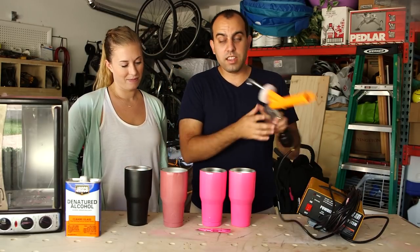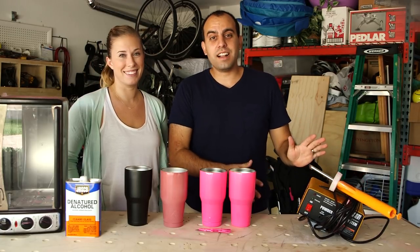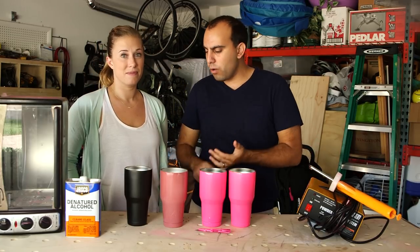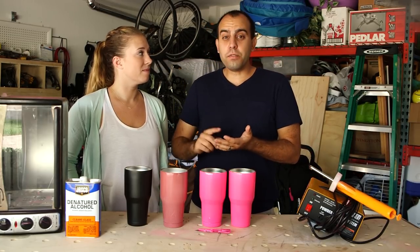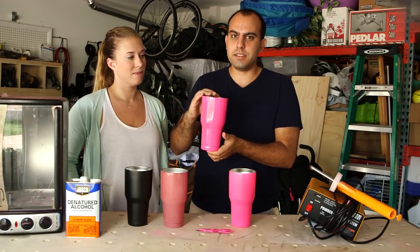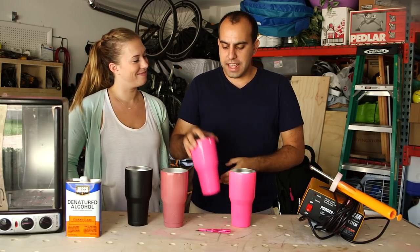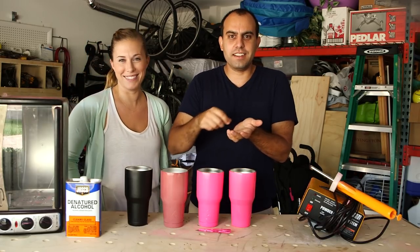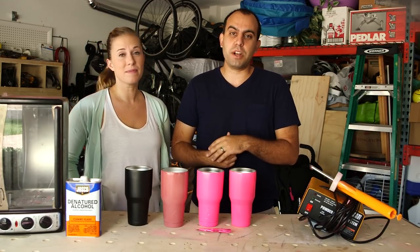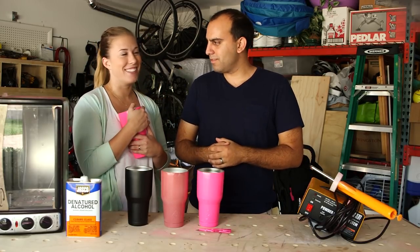I will be using this machine with that matte black quite a bit for metal parts in the future. Honestly for $50 there's no reason not to have this in your shop, because any metal part you use — it's so fun, it's so easy, it's so forgiving. On this one I messed up twice because the machine wasn't plugged in. All you do if it's not sticking right is you just wipe it or hose it off, scoop the powder back into the cup, and do it again. It's very, very forgiving. I would rate this as a beginner DIY type of project. I had fun — and I'm just so excited, I wish you guys knew how excited I was about this.